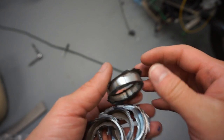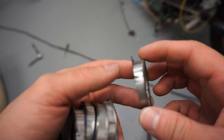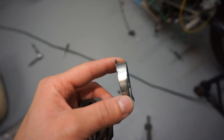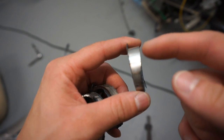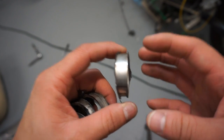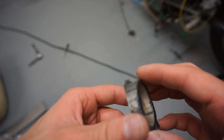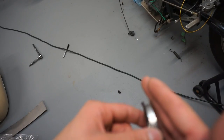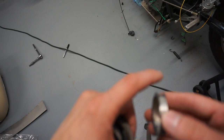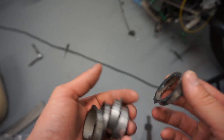I've cut up all the pieces on my chop saw. I don't have a dry cut blade — I have one of those black ones that makes a lot of mess. Something I didn't find when researching how to do these cuts: the reason you mark center lines on both sides of the pipe is so that when the piece is in the machine, you cut one side and then rotate to the other, so the short side always touches the gate line. I don't have a fence on my chop saw so I just tried to eyeball it, making sure the line was always facing up as straight as possible. That gave me all my pie cuts.